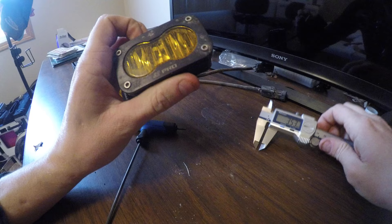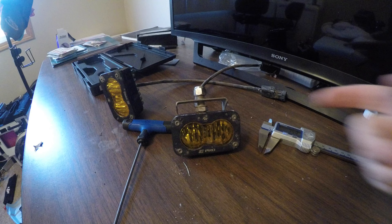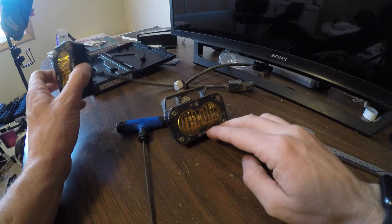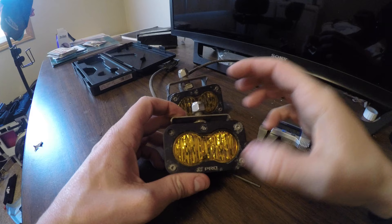I think they're right as far as a 2.5mm goes, so I think what they did was they over-torqued them at the factory. I sent them an email about this, and a rep replied back saying to try jamming a Torx in there, which is a good little trick for Allen heads. But that's how I ended up breaking this one — I pounded that Torx in there and twisted it, and the head of the Allen bolt busted off. Garbage.